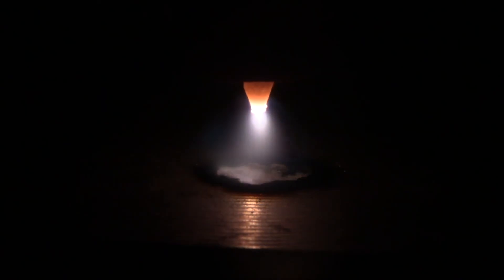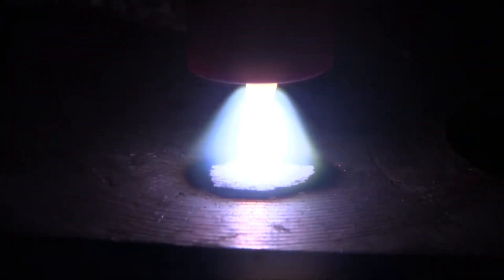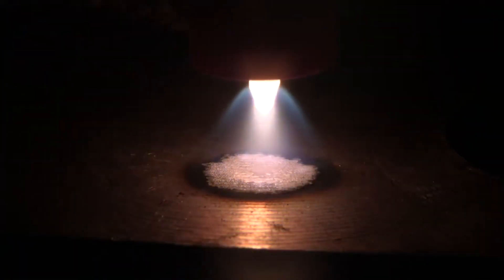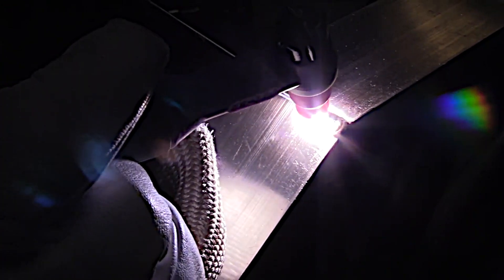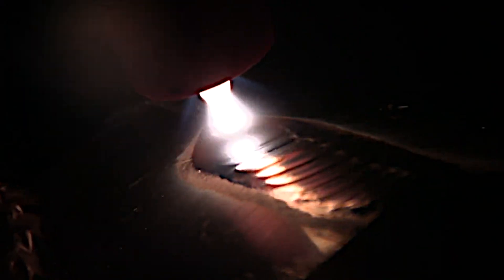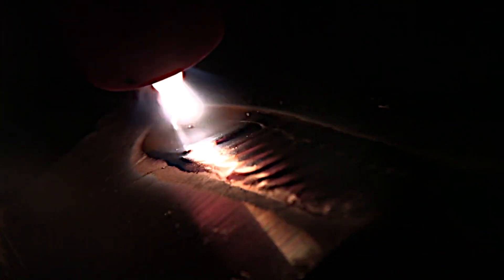The way you do that is just put it over a clean piece of metal like aluminum or copper and gradually go down on the pedal. Watch the tip very closely — you can see it's getting really bright, because it's getting really hot. In this case, what I like is just a slight rounded tip on my taper. Let's take another quick look at one of those butt joints. From another angle you can still kind of see that puddle sinking and dropping and getting full penetration, and the tip is staying uniform through weld after weld because I put that rounded tip on there.